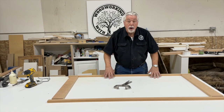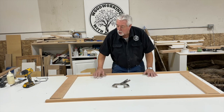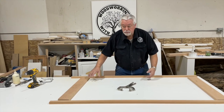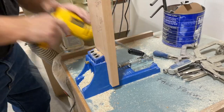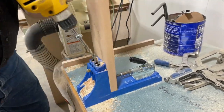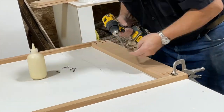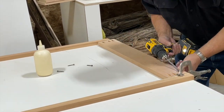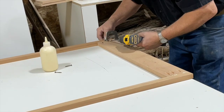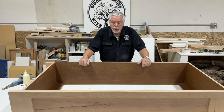This is the configuration of our bookcase face frame. It'll have a four inch top and bottom rail and an inch and a quarter side styles. We're going to go to our Kreg boring machine and drill our holes, flip it over, and put our face frame together.